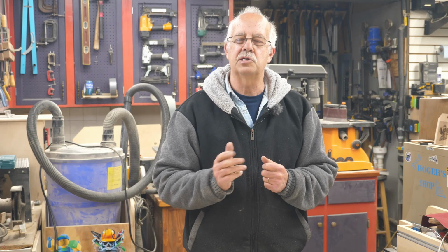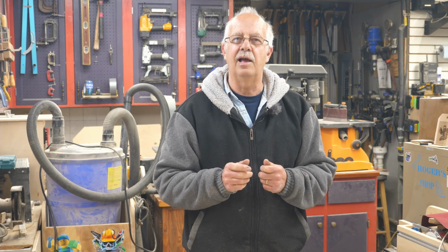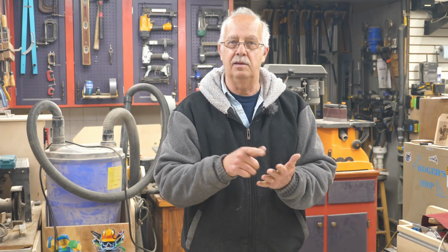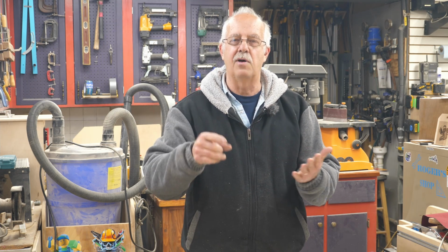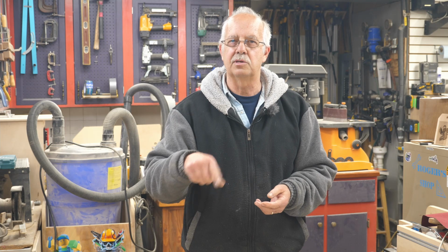Aluminum. If the aluminum is anodized or coated, yes, it will engrave it. Stainless steel. Well, it depends on the grade of stainless steel. I was doing a little bit of testing here with a stainless steel backing plate and actually put an engraving of a leaf on it as it cut through the material I was cutting. So yes, you can engrave stainless steel. However, it takes a very slow speed and high power.